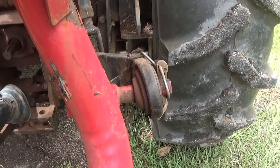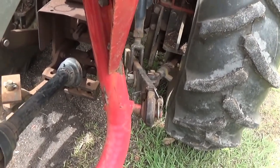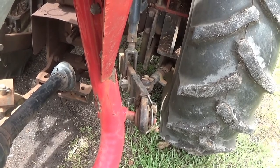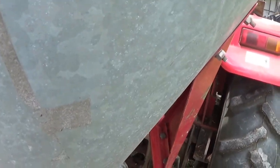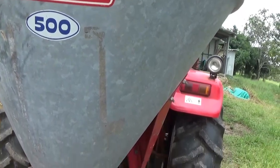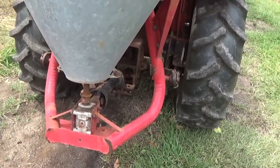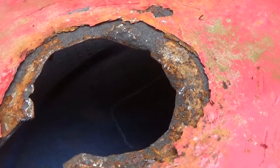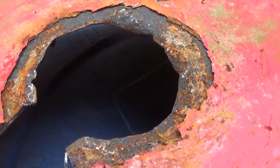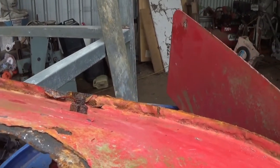While I'm at it, I'll oil all this machine. This machine's not that old - probably about three years old - but really, I've religiously washed it every time I've used it and put a bit of oil on it. Fertilizer is very corrosive, but if you look here at the galvanised steel on the thing - perfect, not a blemish. It's as good as the day it was made. Why they don't, for a few extra bucks, galvanise the rest of it - it lasts forever. On the actual spinner disc, if you look where it was welded on, you can see the metal has corroded away - it wouldn't have been even half a millimetre thick. So that's why it's failed. It's bloody corrosive stuff, and I acknowledge it's not entirely its fault, but wouldn't you think for a few extra bucks they'd use some material that would last a bit longer than three years?